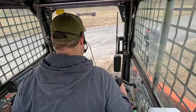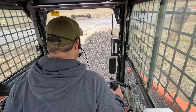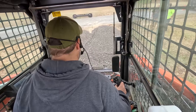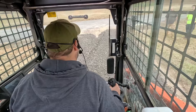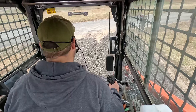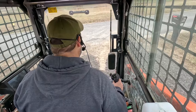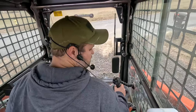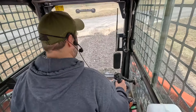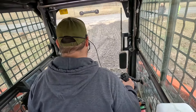I was a little too fast that time — I could feel myself digging in. So I'm just going to go ahead and do a couple of clean-up passes to fix that and slow the machine down, that way I don't completely lose all the work I've already put into it.